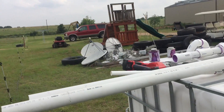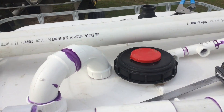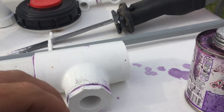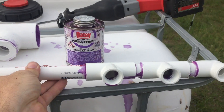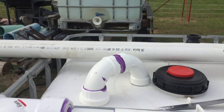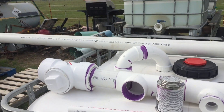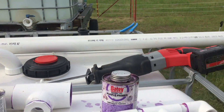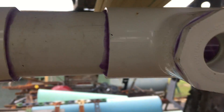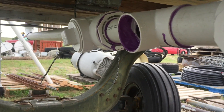Back over here we've got the turnaround for this side, and then this is the middle piece where I have my three-inch, my two-inch, and then my reduced to three-quarter inch. This is the piece for the hose bibs. I haven't cut these yet because I don't know exactly what the dimensions are — I'm not really measuring anything. It doesn't really matter what these lengths are as long as they end up fitting together. It's not going to be standard for anyone, so there's no point in me measuring it for my dimensions. The length of this piece is not nearly as important as the orientation of these pipes — they need to be sloped slightly down so the water will drain. It is gravity fed, so all the water needs to go downhill.